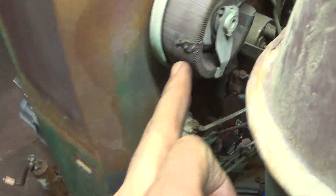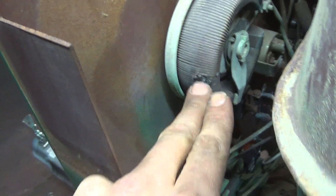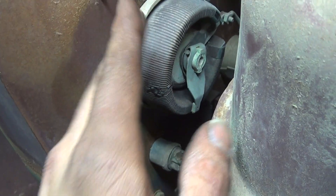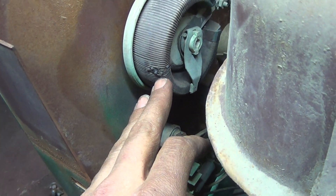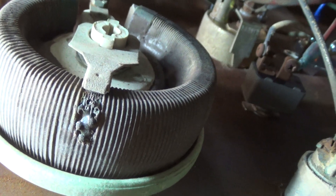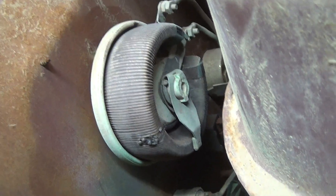I did see this — there's a really nasty arc mark across the fine rheostat adjustment. I do have a new rheostat on hand, but I'm going to wait to change that out until I can do some actual test welds. If there's something else wrong, I don't want to burn up a brand new rheostat, so we're going to leave this one on for a while. Maybe somebody has an idea as to what would have caused that type of issue — I'm not sure exactly what happened there, but if anybody has some ideas, that'd be great.